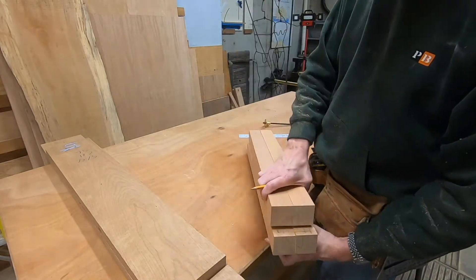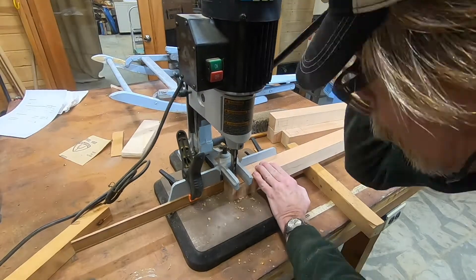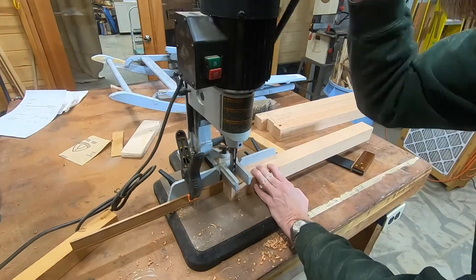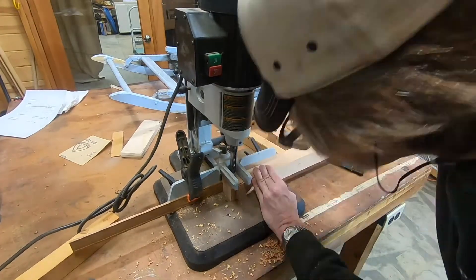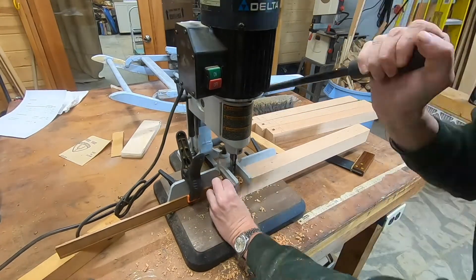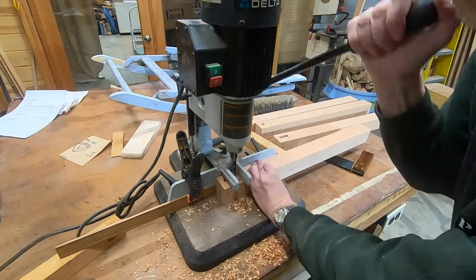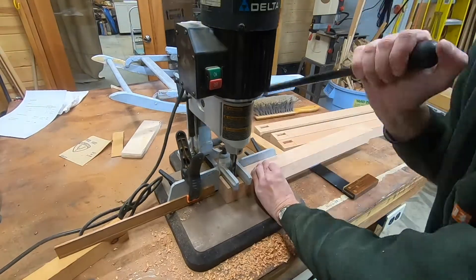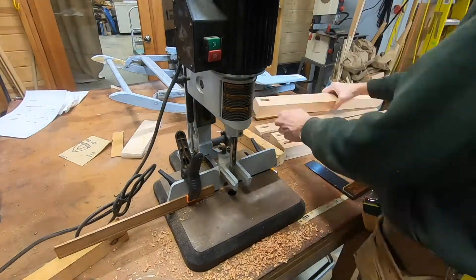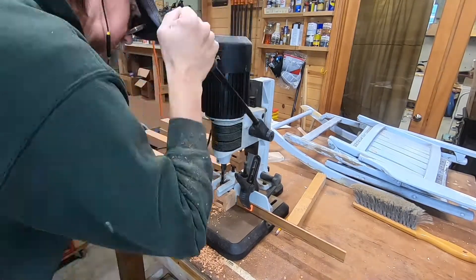I keep them all in the direction they need to be, and I'm fortunate enough to have a mortising machine. I built a lot of craftsman furniture — like eight chairs for a dining room — so it's nice to have the mortiser. I just have a little stop block set up there to give me my width, and then I have to put the stop block on the other side to do the other mortise.